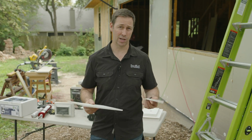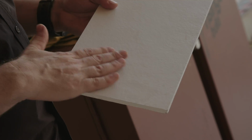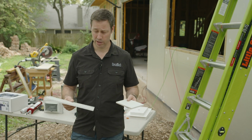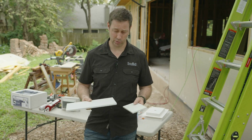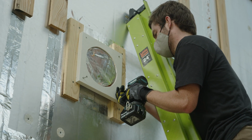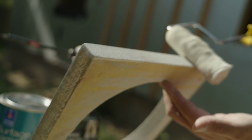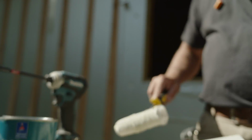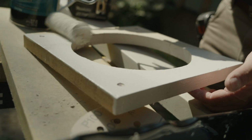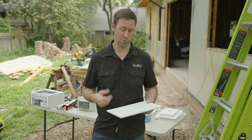because this is gonna dictate how you're gonna make your mounting blocks. In my case, I'm using James Hardie siding on my whole house. I'm also doing this for soffit and trim. And I'm doing their ColorPlus system, which means it's pre-painted, which also means when I think about my mounting blocks, I'm gonna wanna think about how I'm gonna paint those or take care of those. I might go ahead and order those in the pre-painted Hardie material, but in this case, I just ordered that Hardie material package, so I got the primed material to make these mounting blocks.